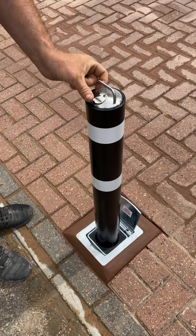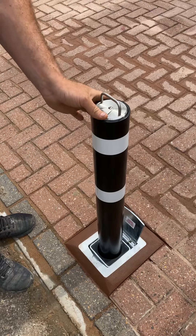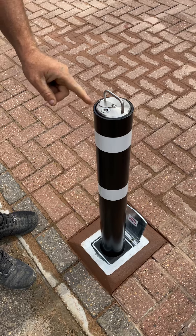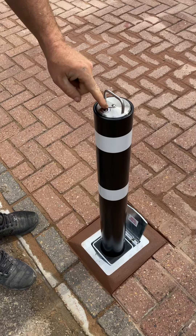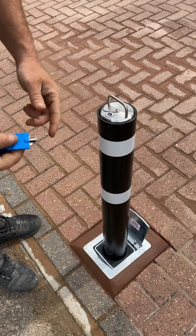This is an R Black R5. I'm going to show you how to unlock it. Sliding the cover over to the left reveals the barrel. There's a groove at the top — I call it 12 o'clock. There are 10 brass pins in there; it's a 10-pin push-button integral lock.